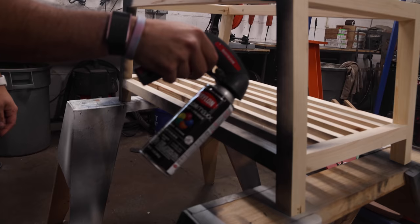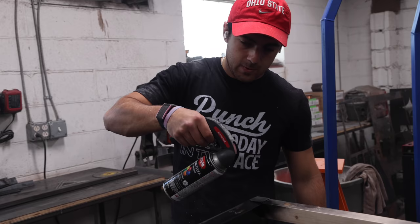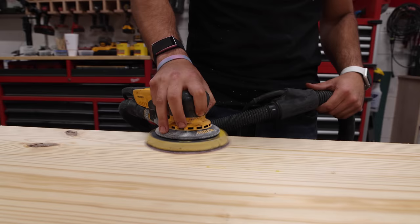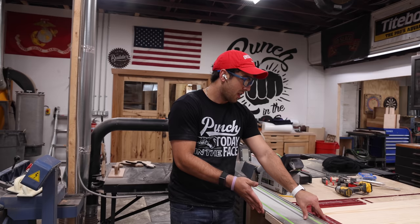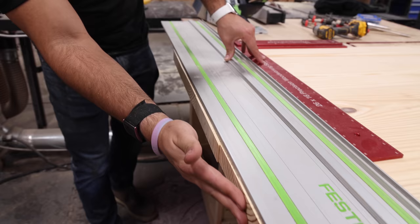You know what time it is — let us spray! When you're building, a good tip I picked up: always make things oversized. That way when you do tabletop glue-ups or big panel glue-ups, you don't have to rely on your glue-up being perfect. As you can see it's not exactly even, so luckily I left it long — that way I come back, trim it off, and you're good to go.